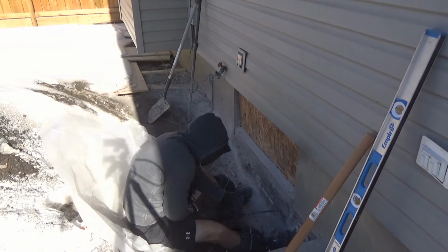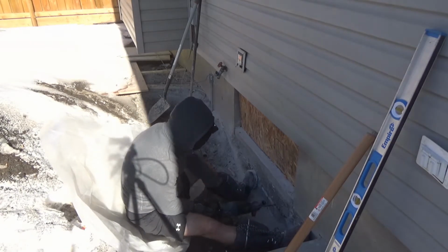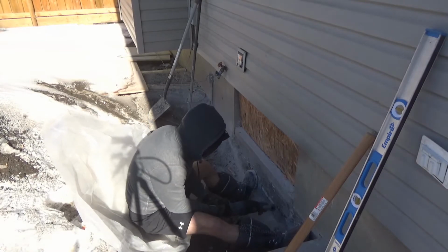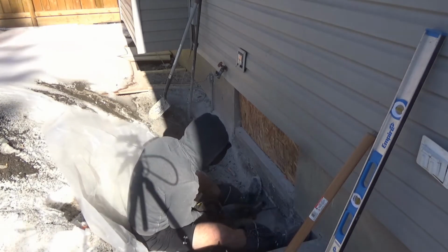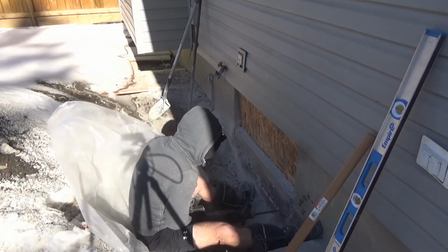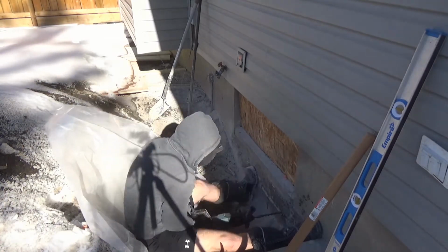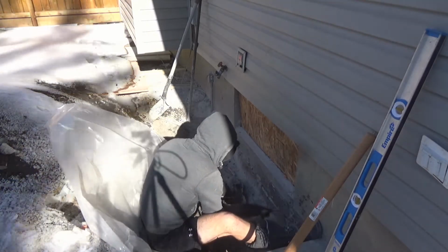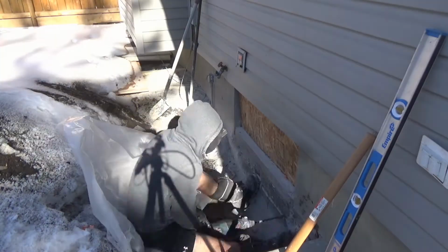So why not one long continuous cut with a saw then? You can rent those cheaply, and you've seen me using my modified electric one on stream, because you all came from my stream, right? To cut footings in my basement and chunks out of my garage pony wall. As I was privileged to explain probably at least 15 times during this job, my foundation walls are about 10 inches thick. The blade for my concrete saw is 12 inches in diameter. That 12-inch diameter has a cutting depth of about 4 inches.